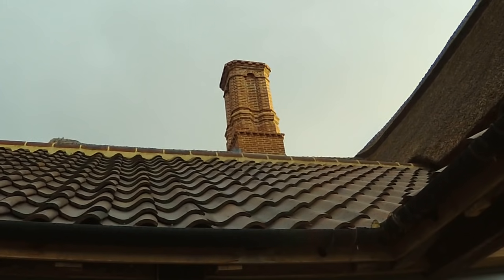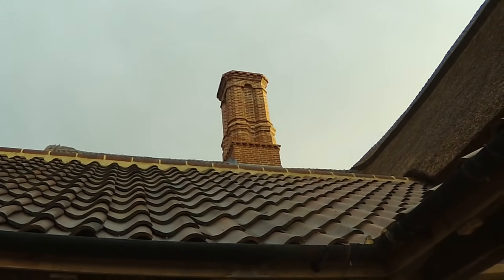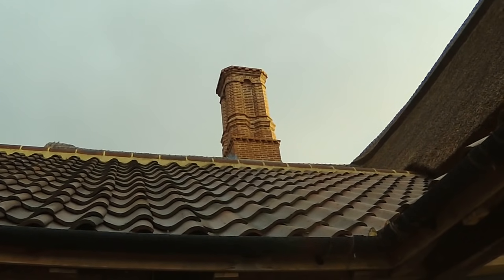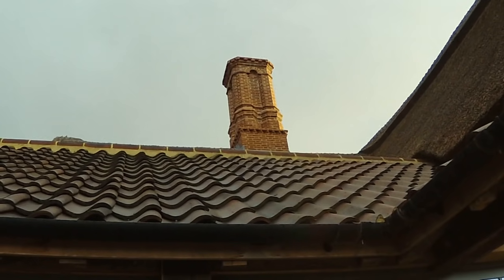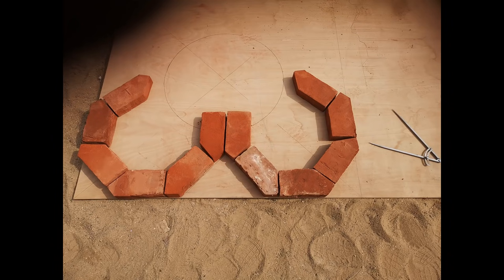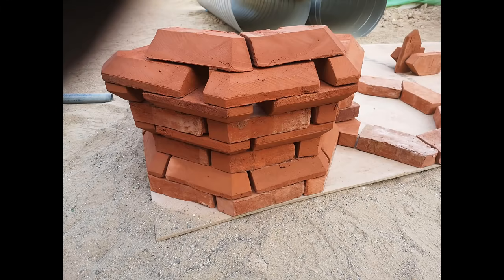This is the barn chimney. You'll see here that there are four octagonal stacks, but these are fake because the actual chimney is just one single flue — a 600mm diameter concrete flue — surrounded by these four octagonal fake stacks. Every brick was cut on site.